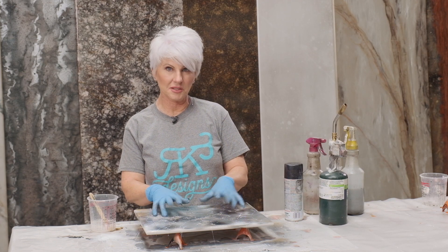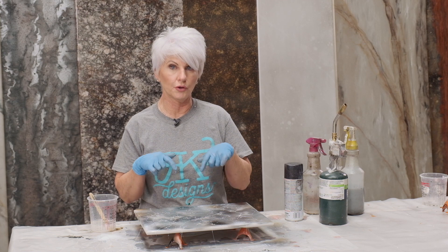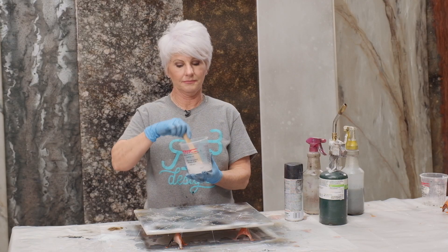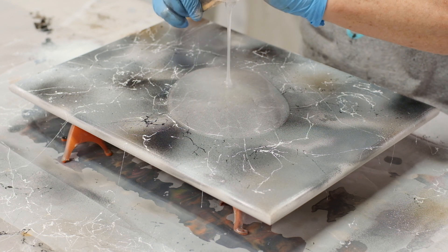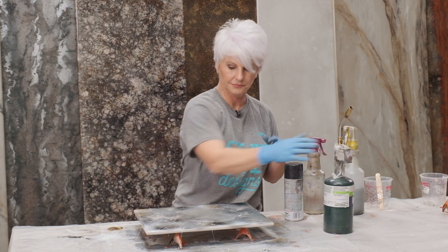We've let the spray paint dry — still a little tacky, but that's okay. This is a finish where you don't have to wait overnight for everything to dry. You do want to let the paint you used for your base coat, the bare paint and primer, dry overnight because that's an acrylic paint — you want those off-gases to come. The spray paint is not as important; for a sample board, it's literally been 15 minutes, but if you let your piece dry for an hour, hour and a half, you'll be fine. Clear epoxy — Stone Coat Countertop epoxy — we're going to pour it over. This is a super fun, fast finish. I'm going to hit it with a little bit of heat before I spread it out — makes it flow a little bit better.